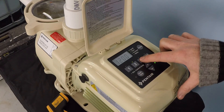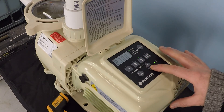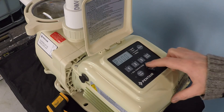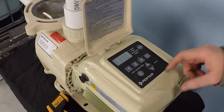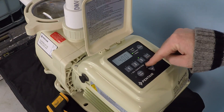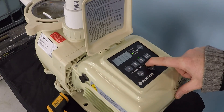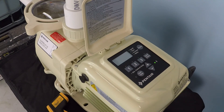Let's say I have a saltwater chlorinator. Two hours in the middle of the night is good for my in-floor cleaner, but my saltwater chlorinator needs a good couple of hours at, say, 2,000 RPM. That's still substantially less than 3,000, so I'll have quite a bit of cost savings. I'm going to run it at 2,000 RPM and lock that in. The remainder of the 24-hour schedule only goes to four hours, because that's all that's left. I'll bring it up to four hours, lock it in at 2,000 RPM, and hit the start and stop button — and that's it.